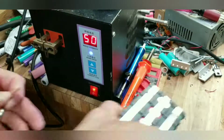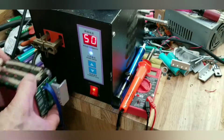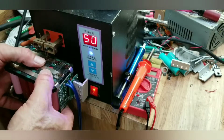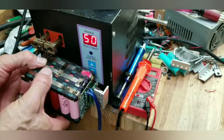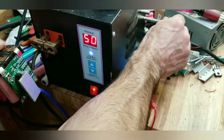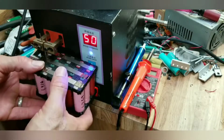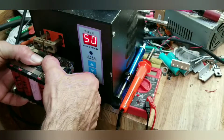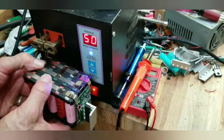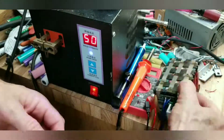We now have a battery pack — almost ready to go. What we have to do is connect the center strip of batteries to the outer strip. I like to wait until last to do this for a couple of reasons. One, I'm not trying to connect a BMS to a live battery pack — if anything goes wrong, everything could be welded together and you've got problems. If something is heating up, it does not just come apart easily because it's welded. And the other thing is, when you come to this side and lay that first strip down, you'll know if you got it right, because if you didn't, your fingers will start to burn as that nickel strip turns red hot. Hopefully you get a chance to pull it off and figure out what's going on, because it's not welded yet. Battery pack is basically ready to go.